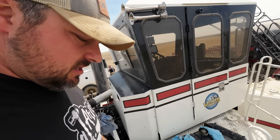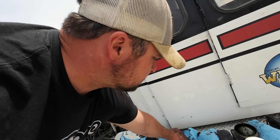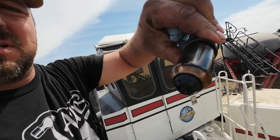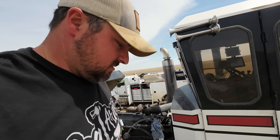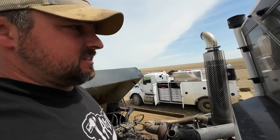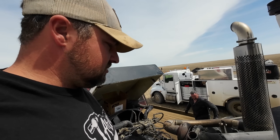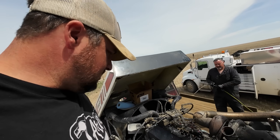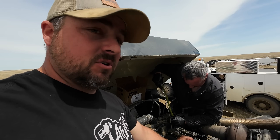What's interesting is one of the injectors on the other tractor had a lot of carbon buildup on the tip, and this one here is looking similar — you can see a little bit of residue on it. It's so hard to say what happened, whether it was just bad parts going into those injectors. The fact that both tractors went down — I don't think it's operator error putting them together. I think it's just maybe bad parts. We'll talk to the people that did them and send these back down to see if they can get them corrected.